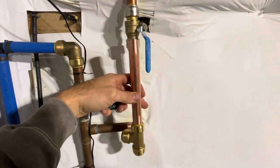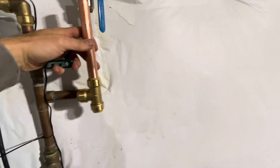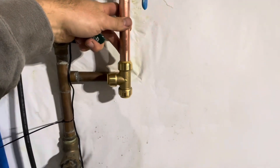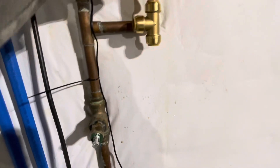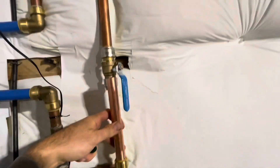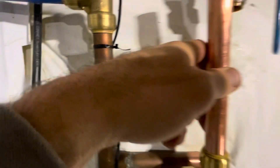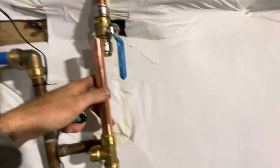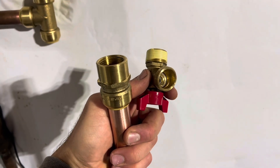To make this easy, it's best to do things in a certain sequence. I put the T on first because I can easily get it up there — it probably doesn't make a tremendous amount of difference, but it's just a matter of what's going to fit in easier. It also gave me the chance to line that up and make sure I had the right height. I did trim it a couple of times, trying to get it so that these copper pieces end up neck and neck right up about there — copper with the brass — because that's where it's going to push into.